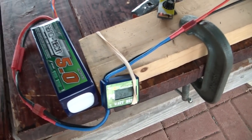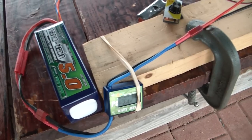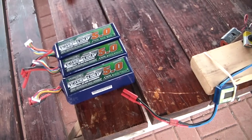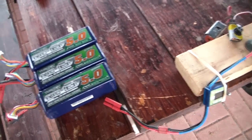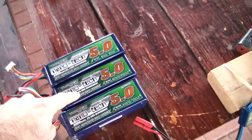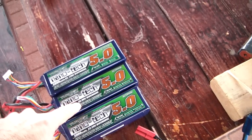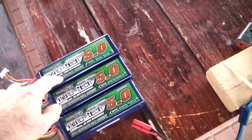That pretty much compares the different packs. At approximately the same resting voltage — within 0.1 volts — and running for about ten seconds each, you can see how the three compared. The thing I wanted to emphasize is that you can't say a 6-cell 5,000mAh pack is going to put out a certain power with a certain motor and prop without considering battery internal resistance. For each step from 25 to 45 to 65C I was looking at basically a four to six percent increase in total wattage, with a total of around ten percent increase in output going from a 25C to a 65C pack.